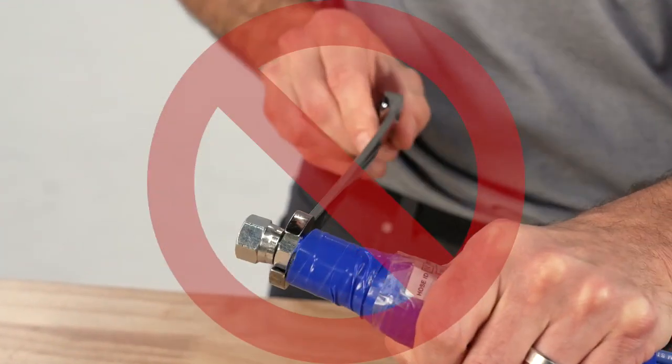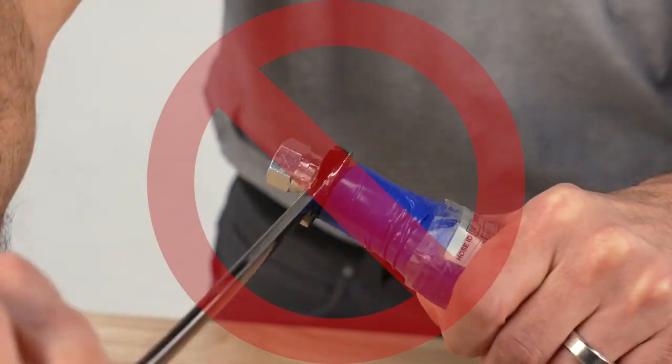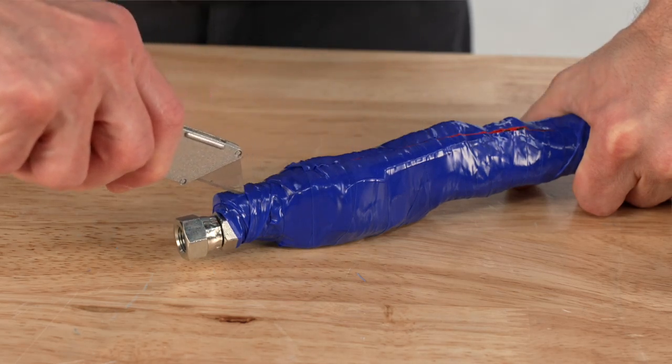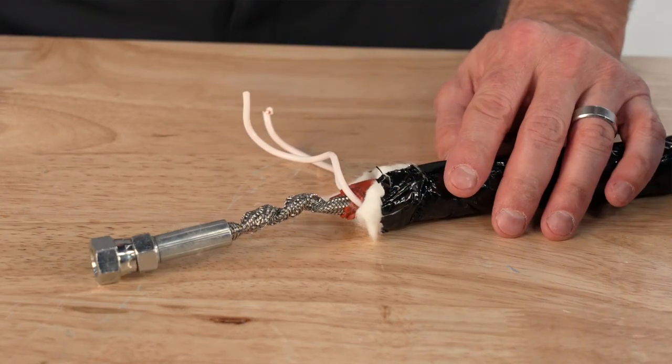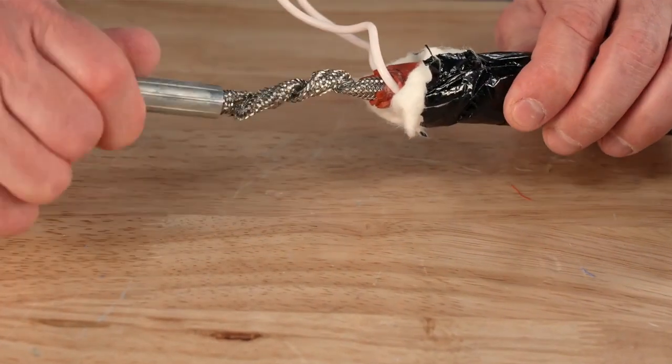This is the nature of the stainless steel hose with Teflon core tube. With each turn, the hose continues to twist. Let me cut away the outer insulation of the hose to show you the result. Here you can see the damage that was done to the hose. This is the damage that was causing the reported hose leaks and flow restrictions.